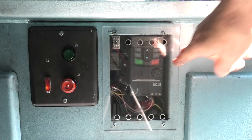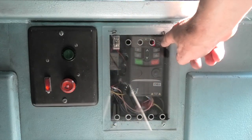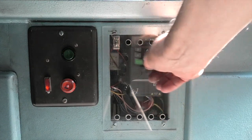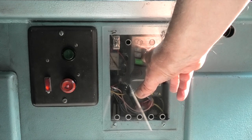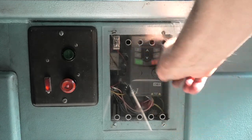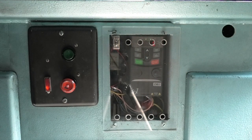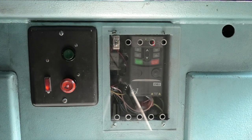This is the inverter inside here. This was where the transformer was for the light with just an on/off switch and it filled this whole space. So I've taken the transformer out, made a box inside to put the inverter in, and also in there there is a small transformer for 12 volt to work the lamp. The switch here is for the light — just leave that on. When the main power to the lathe goes off, the light goes off anyway.